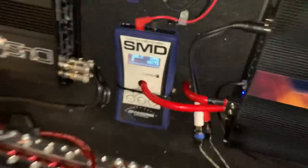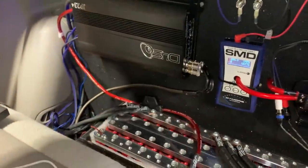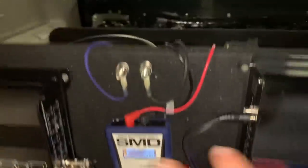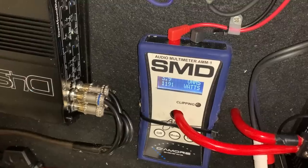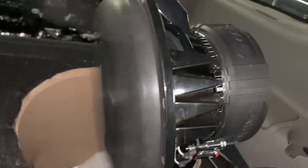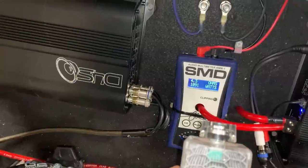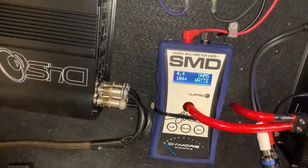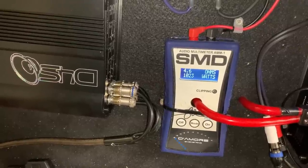We have this set to real-time power. This may turn off before we get all the way through — if it does, we'll set the bass knob down and not adjust anything from there. We've got our timer, going to set this to 40 hertz and start turning it up. The bass knob is super touchy, but there it is. You can see the ohms are rising, so we're losing power pretty quick. Trying to bump it up a tad. 30 seconds in.